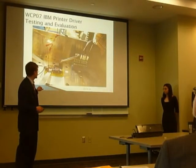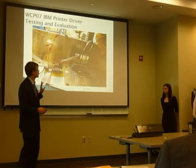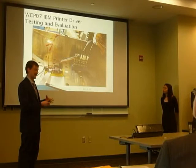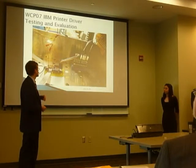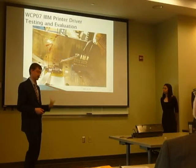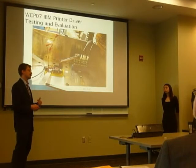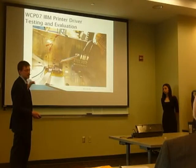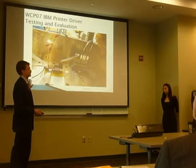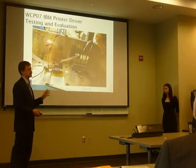On the left is the ChipKit board and on the right is one of the hammer driver cards — this was the final version of the test setup. Off to the right, we're actually throwing an actual hammer, and on the left the printer is giving us sync pulses, so this is the complete system. This USB cable is running to the host PC with the host PC application running. Before we could get to that point we had to simulate all these things: we built an Arduino-based simulator for the printer pulses, a detector before we had hammer driver cards, and powered and integrated everything separately.